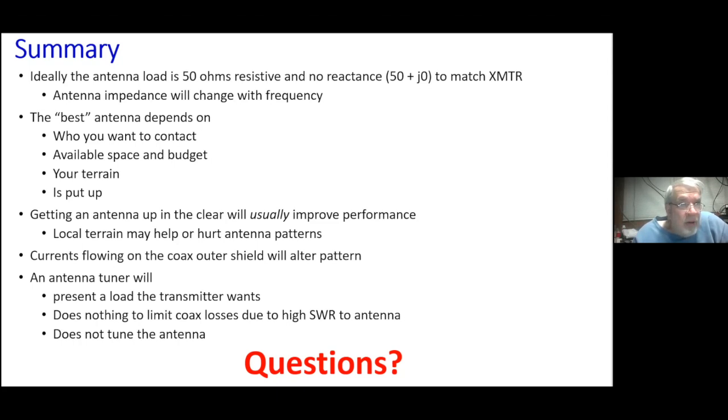Once again, it's not trivial. I mean, we did that quite a bit when I worked at LS Research, but we were using basically antennas that were calibrated with known gains, and we were able to calculate or estimate or have knowledge of those antennas' efficiency from the basics of the design, and they were reference antennas. And then we compared the antennas that we were designing at LS to the reference antennas. And if they were 3 dB poor, that meant they were only half as efficient as an antenna. Not a trivial pursuit, that's for sure.